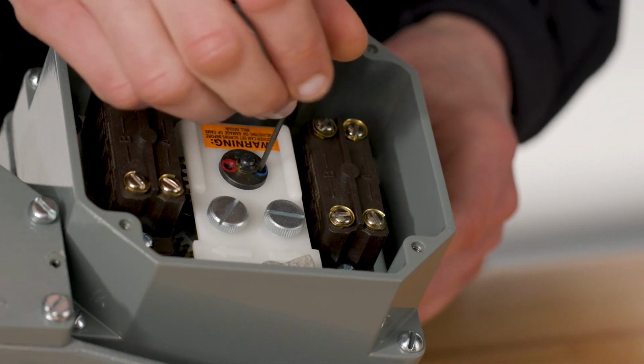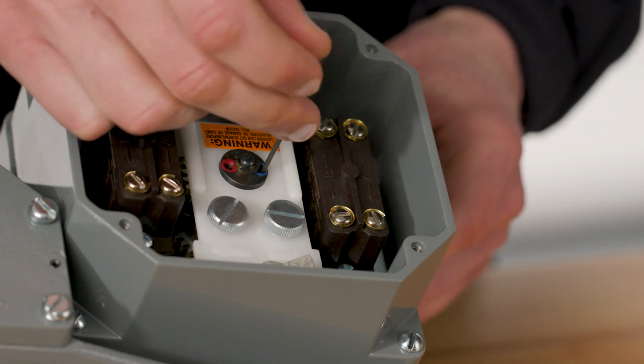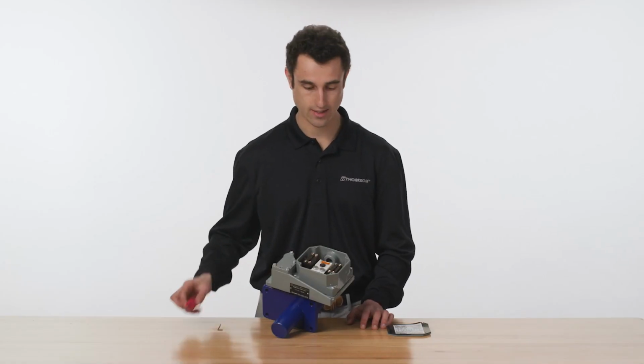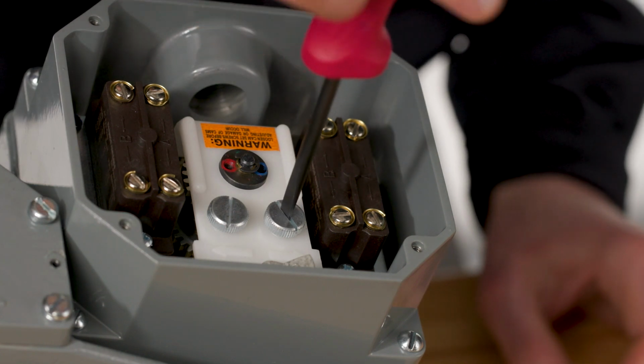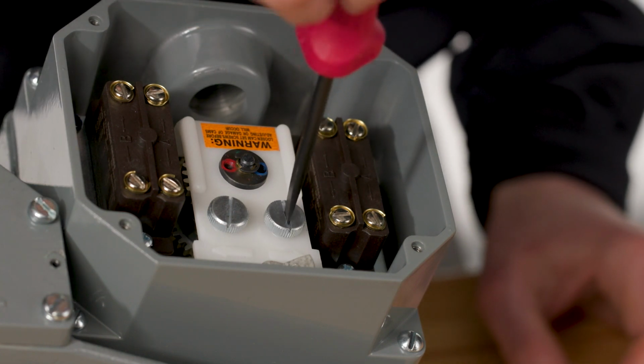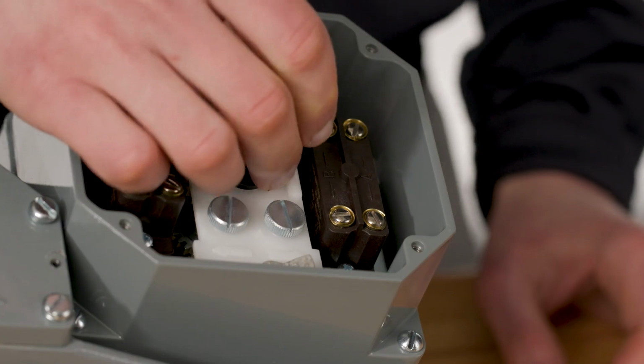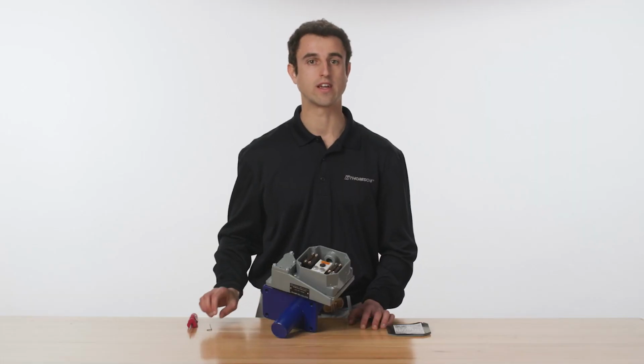Bring the jack to the desired fully extended position. Loosen the blue set screw. Adjust Cam D until contact is made with switch H. Retighten the blue set screw. This sets the extended position of the jack. The end of travel limits are now set.